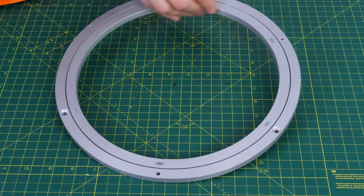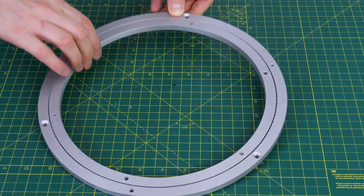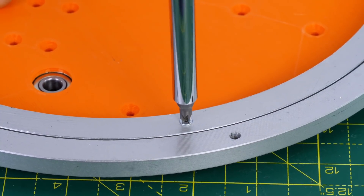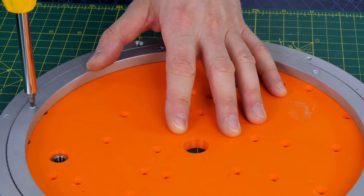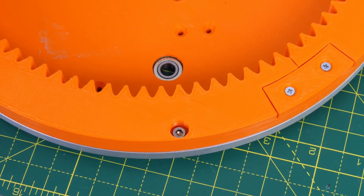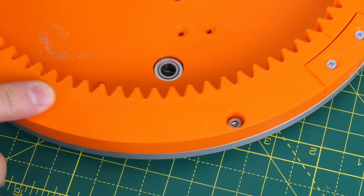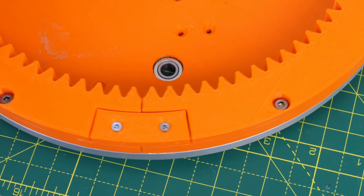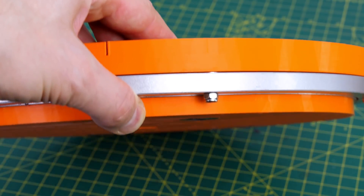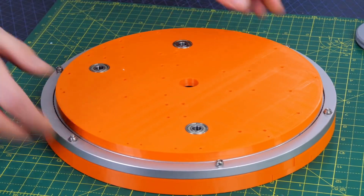The main base of the robot is going to rotate round on a lazy susan bearing which has two aluminium rings and ball bearings in between. I've printed a base that's going to screw onto that and it's got some bearings to mount everything on. Fitted to the outside part is my ring gear printed in three parts that's going to make it drive all the way around. That's going to run on a spur gear mounted in that bearing, and I've also put some tabs in as well as bolting it to the ring just to hold everything aligned. I've used some washers as spacers just to hold that ring off the lazy susan so it doesn't rub on the inner ring and there's clearance so everything runs freely.